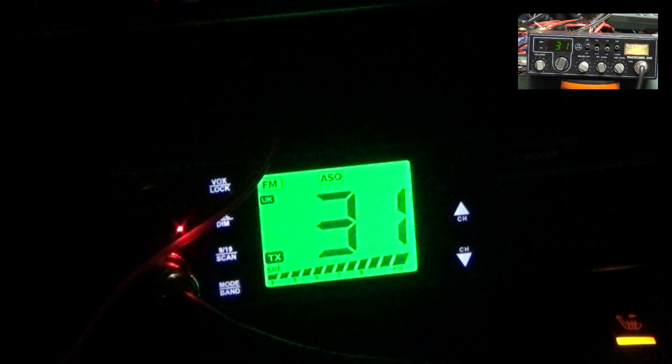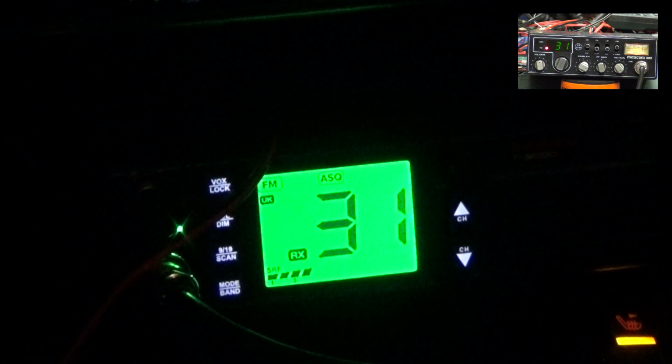We're now at the 5 mile point. Roger, got you at the 5 mile point. I'm on this Maxcom 30 from 1990, this late production. Same chassis, it's been over 9 years, but with a crystal filter. It's drawing 970 milliamps to deliver a full 4-watt output.